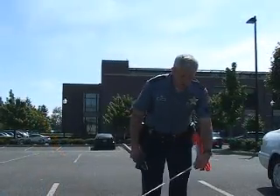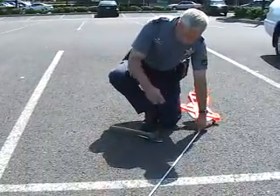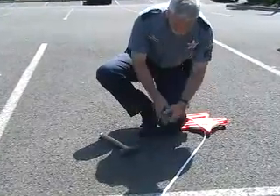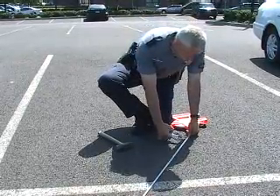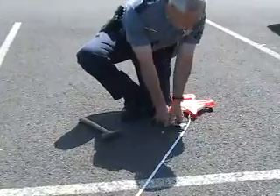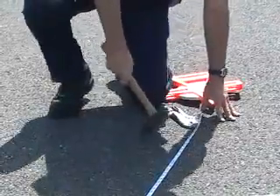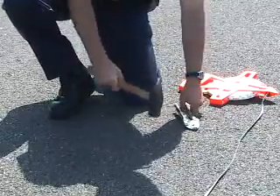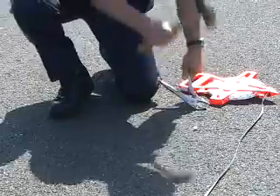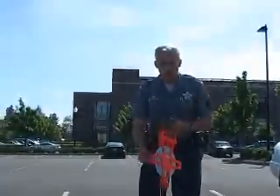Once you get your tape measure pulled out, make sure it's nice and taut and straight. Lay it down and then take a second PK nail, put it into your vise grips for safety reasons, and put it right at the 50-foot mark. Lay that into the pavement. If everything worked out well, that should calibrate the 50 feet on the pocket PC when we shoot our shots.